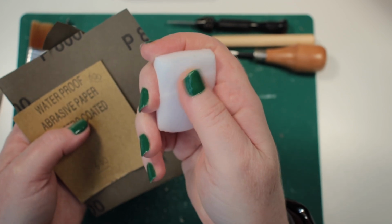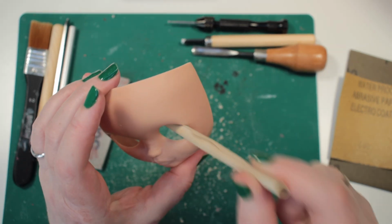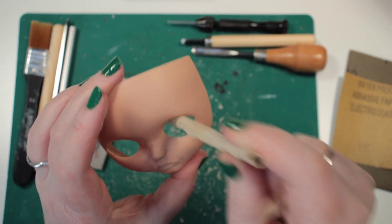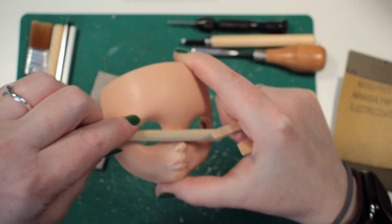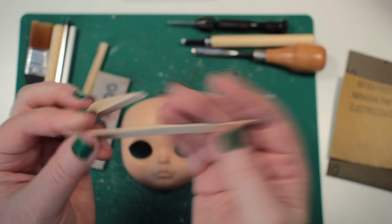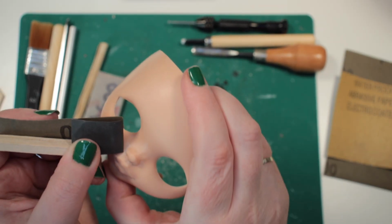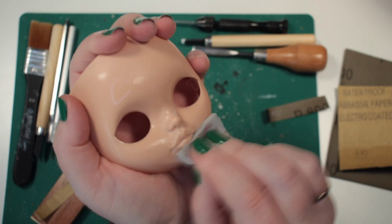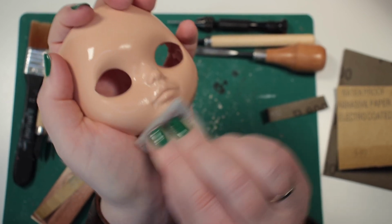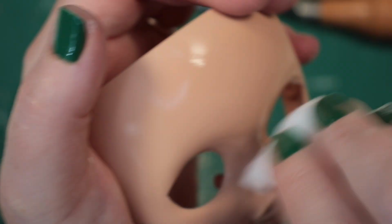Sanding is definitely the least fun and most tedious part of this. If you're looking to get into difficult shapes, you can roll up pieces of sandpaper, or wrap them around pieces of wood or perhaps nail files, things that will give you more grip on the sandpaper and help you get into narrow and awkward areas. You just have to be very patient and, starting with your lowest number grit, get all the scratches out that you can before moving up to the next grade of sandpaper.